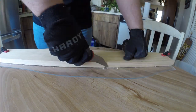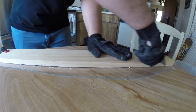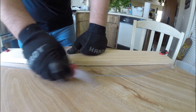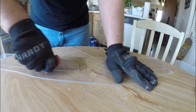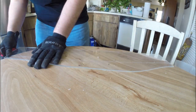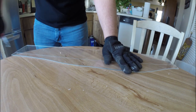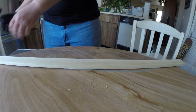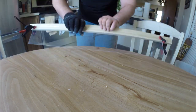The first step is to cut the acrylic to match the width of the wood we're using. I'm going to do this by clamping the wood to the acrylic sheet and using it as a guide to score the acrylic with a plastic cutting tool or utility knife. Once we have a deep enough cut to no longer need the wood as a guide, I'll remove it and finish scoring the acrylic freehand so as not to risk damaging the wood. Once we're finished scoring it deep enough, I'll clamp a piece of scrap wood along the cut line to act as a brace while we snap the acrylic along the score line on the side of the table.